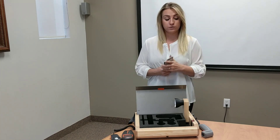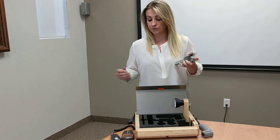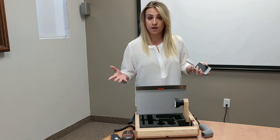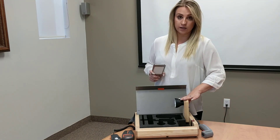We're going to test the heat gain using our thermometer, and we're also going to test the amount of sunlight coming through the fabric using our lux meter. Because we can't get a sun in here, we're going to use a halogen lamp, which does give out a lot of heat and a lot of direct light.